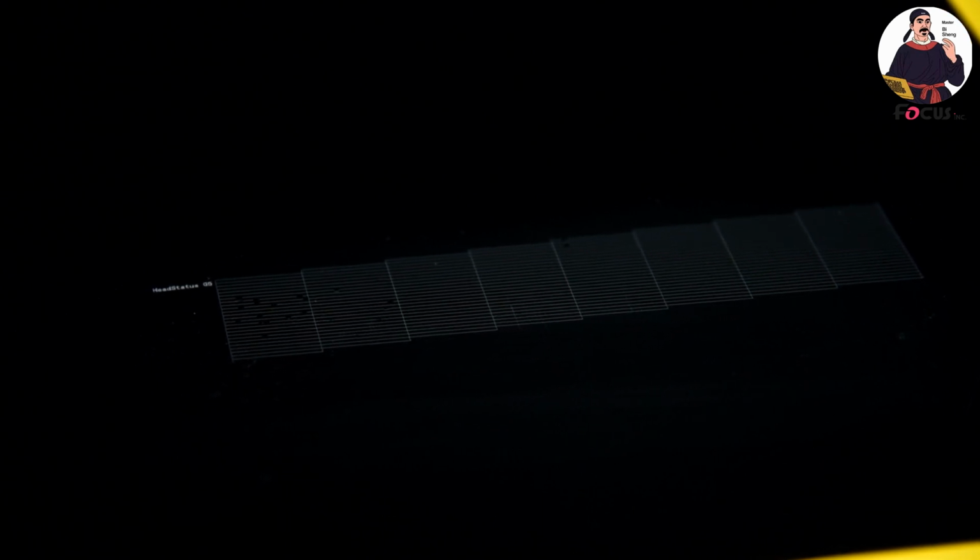If you cannot get a good white ink print head nozzle status, you cannot get a good white ink density for printing on a dark t-shirt. So this is very important. After we do the nozzle check for the white print head, we need to do a nozzle check for the color print head. So we just need to put a white paper on the surface of the table.